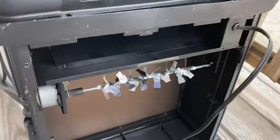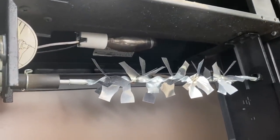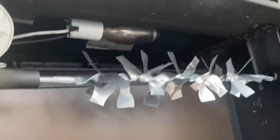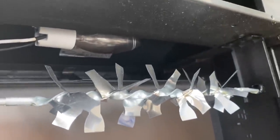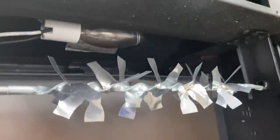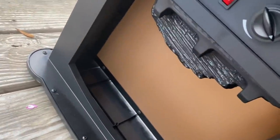Just to satisfy my curiosity I opened this up - took the back panel off - and I learned something. I didn't know how they achieved this illusion of fire. There's a light bulb - not to exceed 40 watts it says, to avoid risk of fire. The light shines and hits strips of aluminum as they rotate on a little rotisserie, then that goes through a screen and appears to be flickering flame on this side. That's pretty cool.